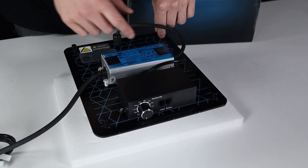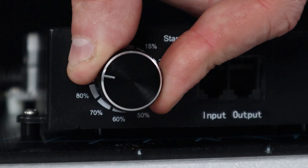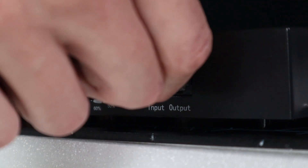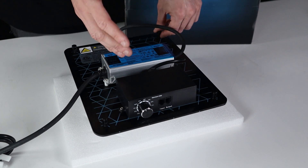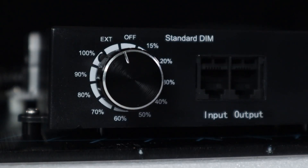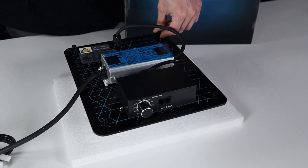On the front we've got the dimmer module. There has been a nice change there — with these click increments for manually adjusting it, we also have RJ ports in the front. Those RJ ports mean you can connect it up with a controller such as the AC Infinity control system via an adapter, or a master controller for managing your light remotely. If you have multiple lights, you can use it as a daisy chain function to run all of them off a single master. Note that the last notch of the dimmer is EXT, which stands for external control — that's where you set the dimmer when controlling the unit remotely. Really nice to see commercial features being used in domestic applications.